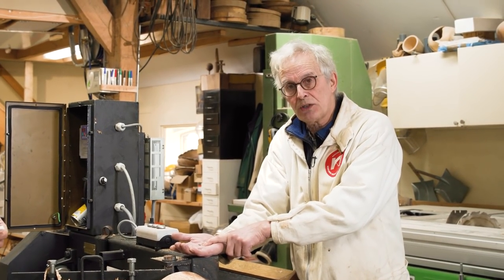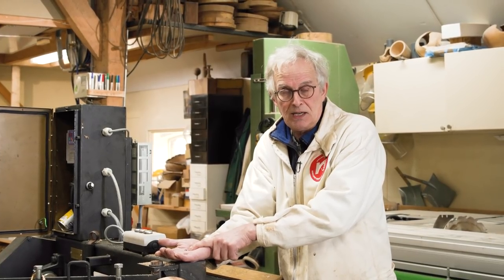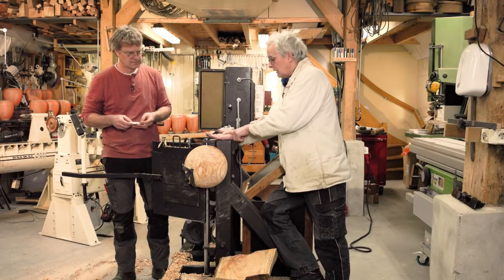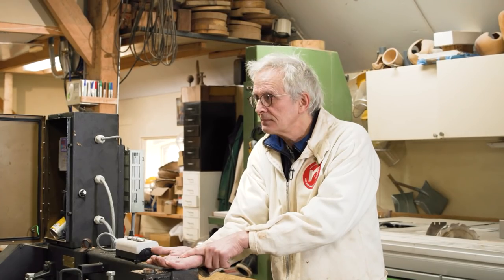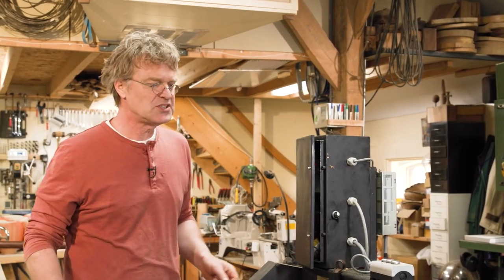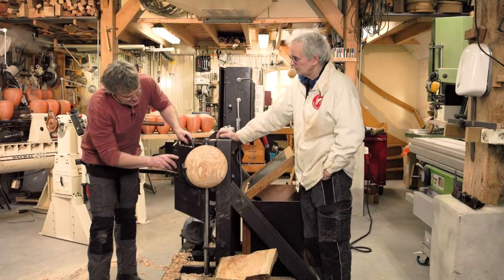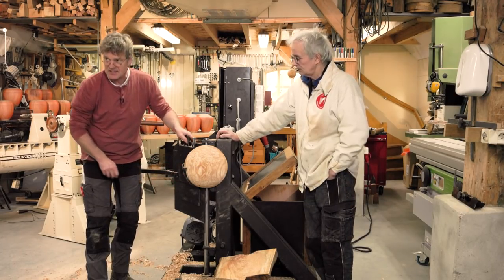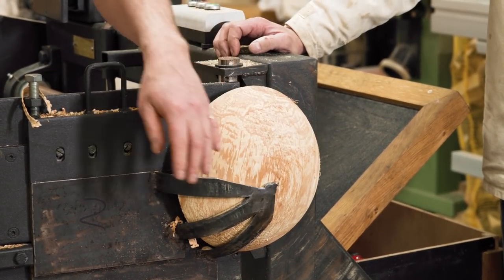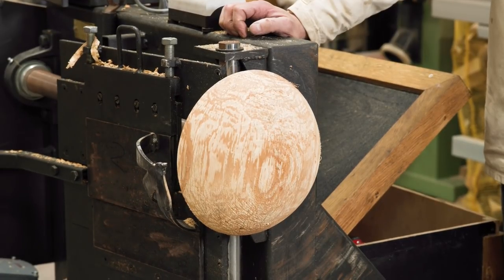And they're interchangeable. You can turn them around, you can use them on both sides. It's not my idea. I saw this on internet, as most of my ideas I see on internet. But we built the cutter around these interchangeable inserts. And it was, I take it back, right? Yes. And how to position it exactly was quite a thing, because of course it has got to cut on the center height exactly, because in the end over here it's got to be in the center, because if it's above or beyond, well, there's wood left in the middle and the rest of the piece won't fall off.